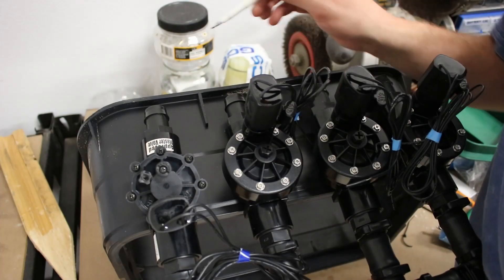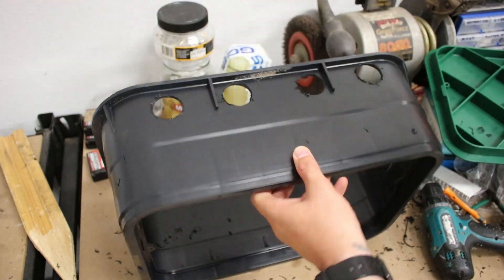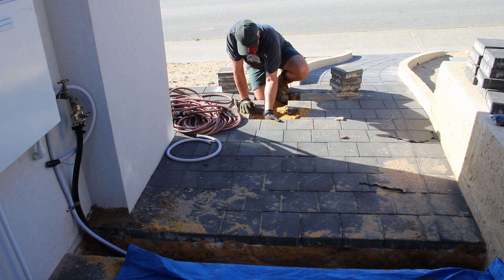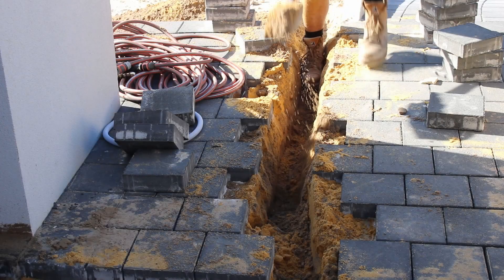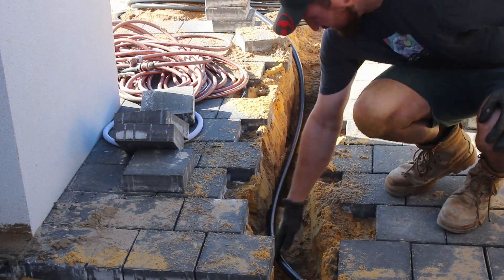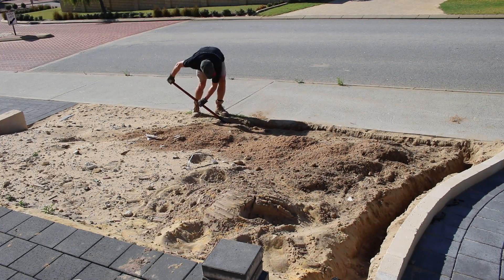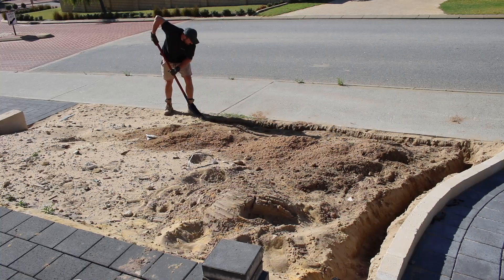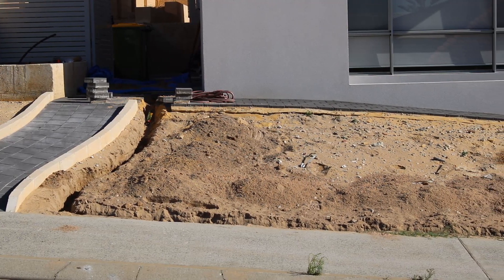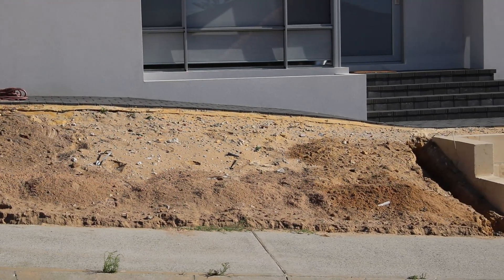I cut some holes in the plastic shroud so conduit can be connected in the garden. With three stations I started running retic piping for each — station one goes back under the retaining wall, under the bricks, and out onto what will be a front lawn. I was a little too ambitious with my original design and spec'd way too many sprayers for the pressure of my system, so I trenched retic piping to all four corners of the front lawn. In the end I only needed two sprayers to cover that area.